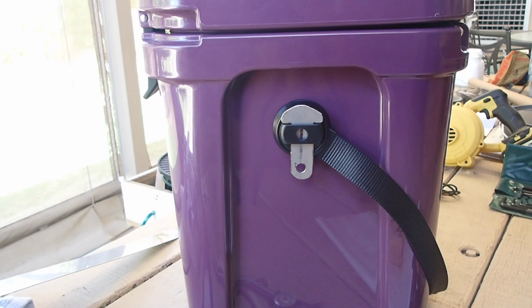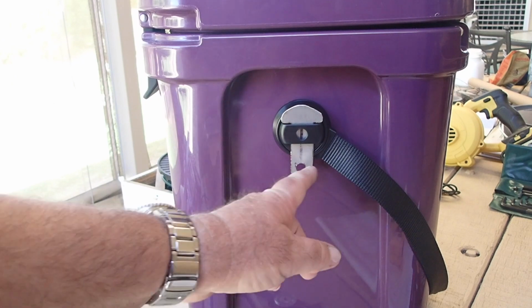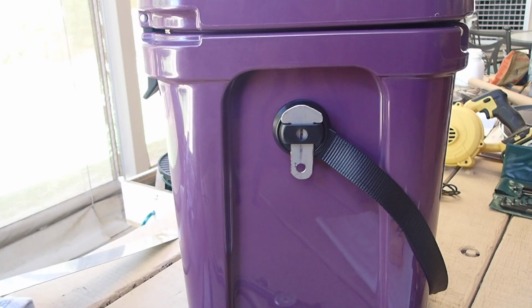Now that's stainless steel, so it work hardens, so when you drill it you can't fiddle around, otherwise it gets quite difficult to drill. But I think that's a winner, guys. So either a second one on the other side, or two in one slot, that might be a solution. I mean, unfortunately in the days of cordless grinders you can't make anything foolproof if someone's determined. That would certainly slow down the grab and go opportunist anyway.